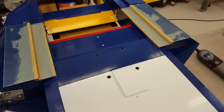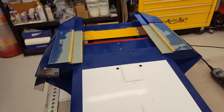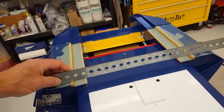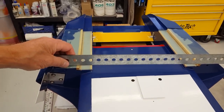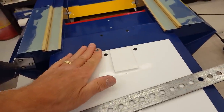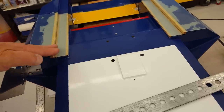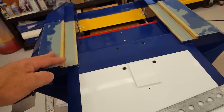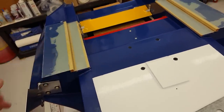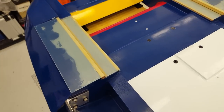On the Eliminator I run it this way, but this boat I experimented with — none of my boats are ever the same. What I would call the ride height on this boat is the height if you place a straight edge across the ride pads and measure to your ride surface, which is easy on this one because it's flat all the way out. That's your ride height. Then you can go shallow or deep, whatever you want to do — angles or no angles, drastic angle of attack or none, big step, little step, no step with a taper — all kinds of different ways to do it.